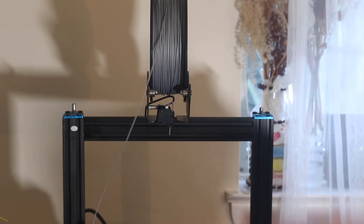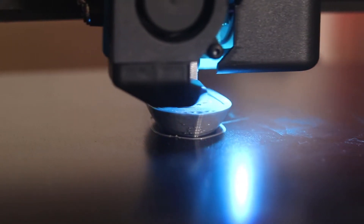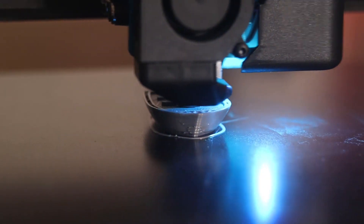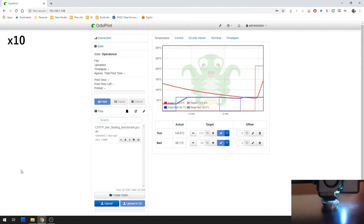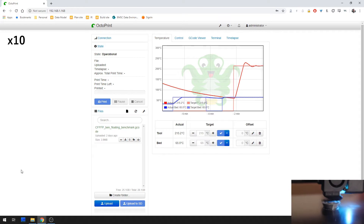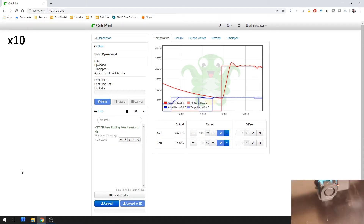While it's printing, let me show you something. I'm currently printing from a thumb drive and using OctoPrint only to monitor the printer. I've noticed that when changing temperature, the printer significantly overshoots and undershoots, as you may see here. I tried doing PID calibration, but many times it was overshooting so badly that the calibration procedure just failed with an error, something like 'PID calibration failed, temperature is too high.'